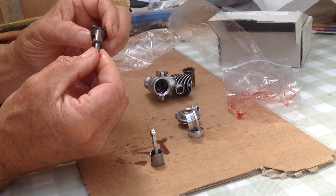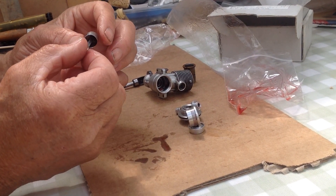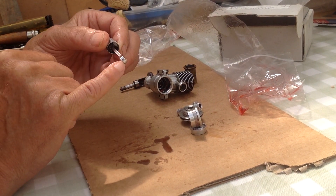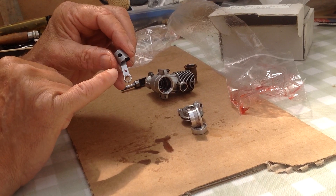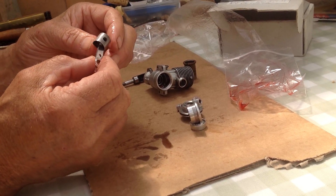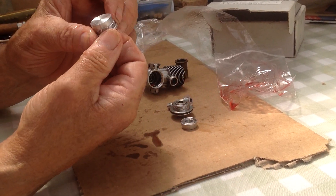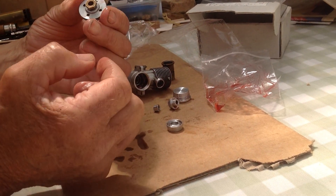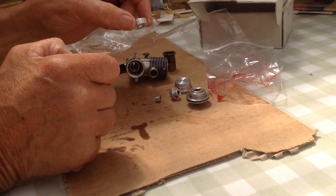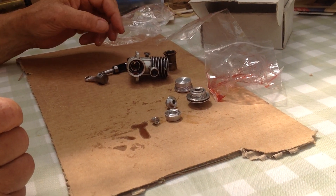Nice web, fused in, lovely job. Lightweight piston — look at him, lightweight. Seriously strong conrod, brass bush, two holes for lubrication, and probably some at the top. There's a little mark on there so that goes at the back, so the conrod and the piston go the right way. This has had a little bit of use but notice the nice rim on the top of the piston, clean as a whistle, lovely job. Bits and bobs: back plate, screws, cylinder head screws, the diesel head — I've shown you the glow head — prop driver, collet, prop nut.